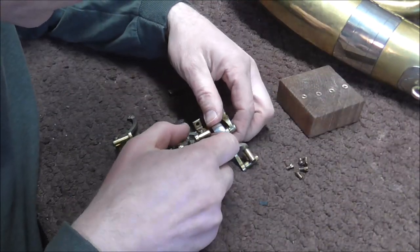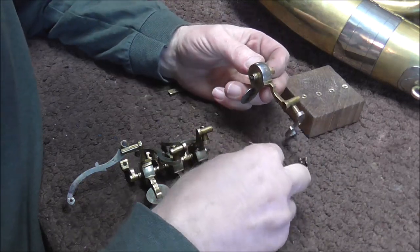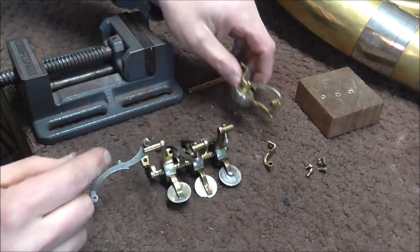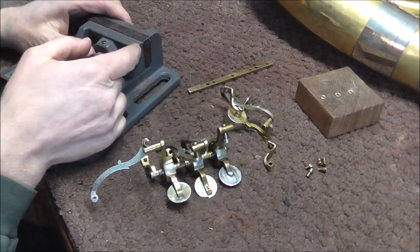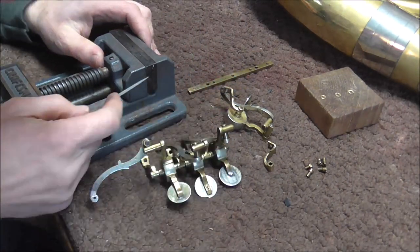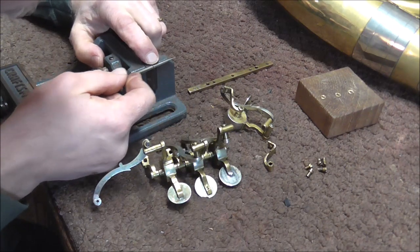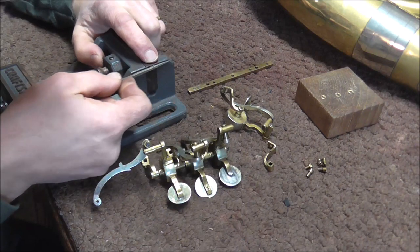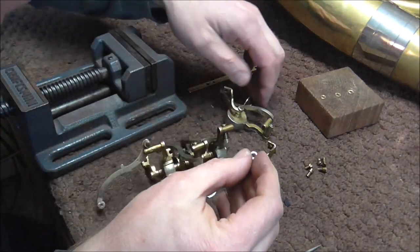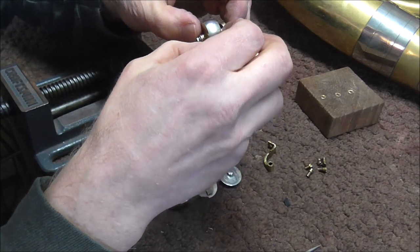So what I'm going to do is take off the first one and put in the spacer. I did run into a little problem — because these are square, the hole in the washers would not fit into them. So I chucked it into the vise. I'm going to take a square needle file and file down some slots to make that square. I need to be careful not to file it down too far, because then it will fall apart. That should be good, so I'm going to try that again. I'll put that on there, and this time it fits. So I got the first one done.